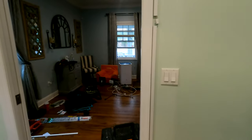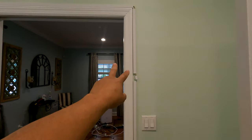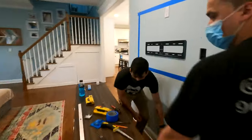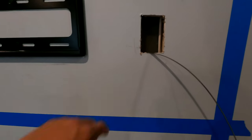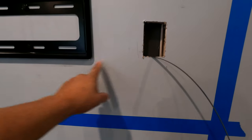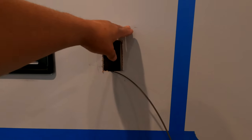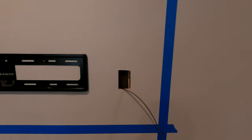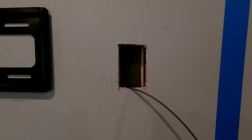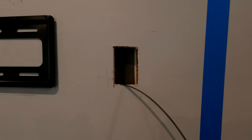The way we determined where to cut is we needed a point of reference. We used this molding as our reference and measured off it, taking into account the offsets with the additional wall in the way. We determined that on the other side of this wall you have one closet starting here and the other closet going that way — so that's our median line. We also needed to be under the shelving itself, and considering the perimeter of the TV, we placed the gang here knowing we'll be behind the TV and meet the other side of the wall where we need to.